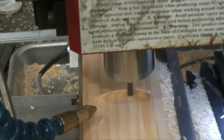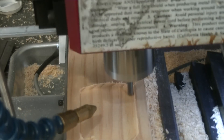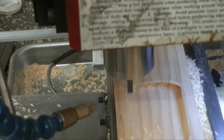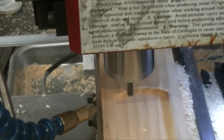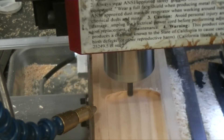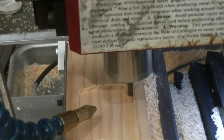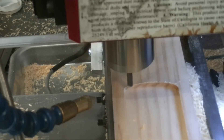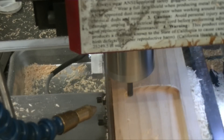It's pine, so it could go a whole lot faster, but the finish suffered quite a bit — it started to see a whole lot of tearing in there. Even though physically with a softer material like this it's possible to go faster, really anything over about 40 inches a minute was just leaving it in poor quality.